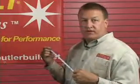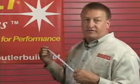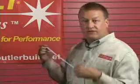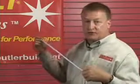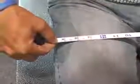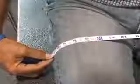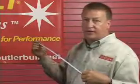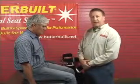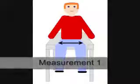A flexible tape measure is most commonly used to generate these measurements. One of the things that is absolutely imperative when these measurements are being made is that this tape measure is held in a perfectly straight line. We do not want to flex it or curve it around the curvatures of the body. That will generate a completely inaccurate number. We need only 7 accurate measurements to manufacture a seat just for you.